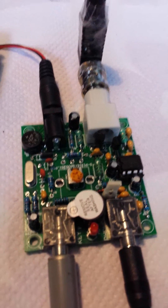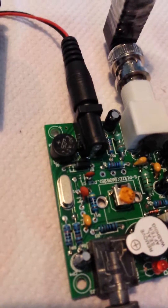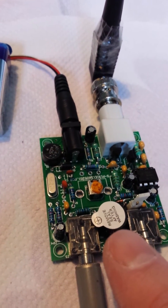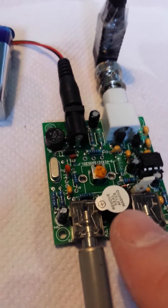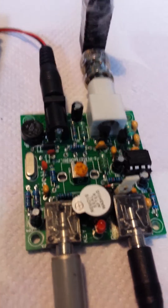As you can hear, there's an annoying little buzzer on here so you can hear what you're keying. Thankfully there's a little jumper you can remove — I'll move it over so it's not connected, which disconnects the buzzer. The buzzer has this wonderful translation on it from Chinese: 'remove seal after washing' — I think it probably means 'remove seal after installing' but there you go.